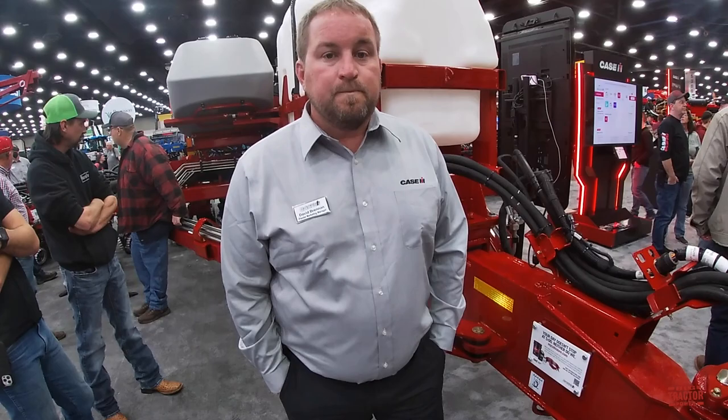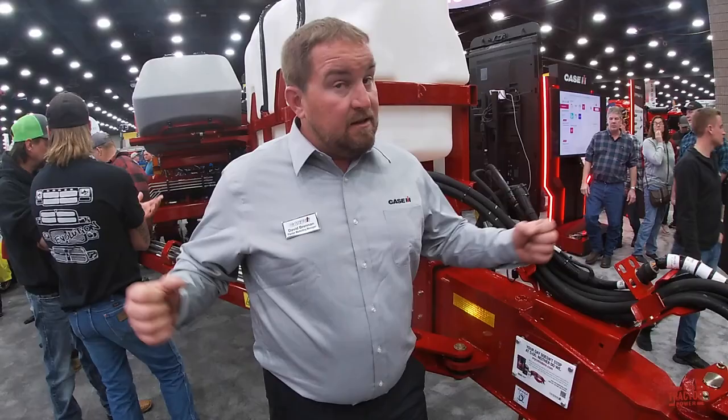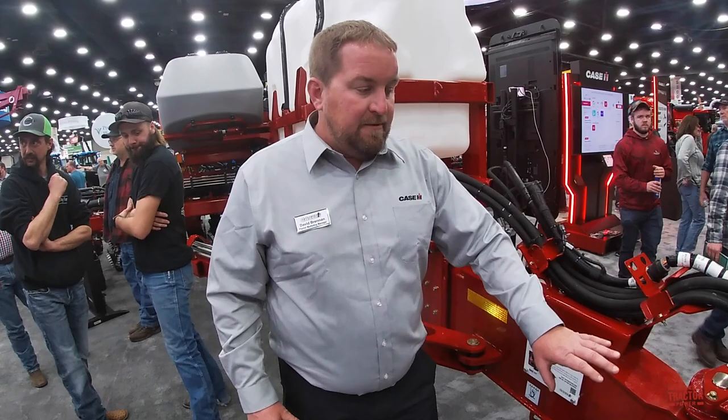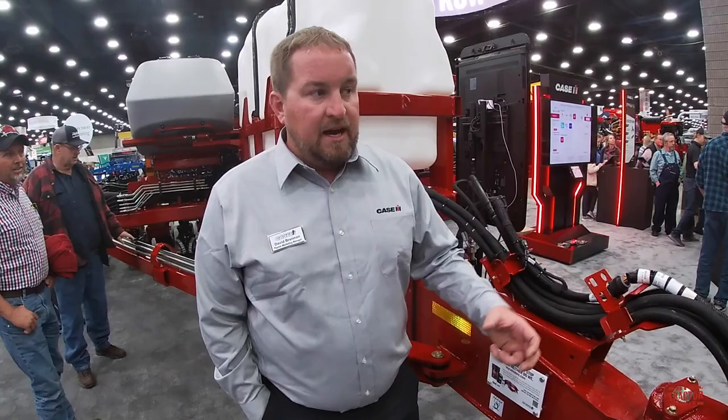That's a nice feature, and I really liked it too for the corners. When it came up to the corner, you kind of just twist right around and back in and square it off with ease. And it gives you a lot of control, really, of that planter. There's a lot of weight back there, right? And so we're going to control that well. Larger cast design than we've had before in the past on our previous models. So we understand we're pulling these planters faster, as we discussed, through the field. So making sure that we've got that right connection to the horsepower out front, the tractor that's out front. Then also cleaning up just hydraulic routing as well, hose connections, minimizing the number of hoses we need for that hydraulic output from the tractor.